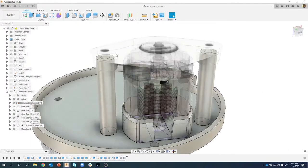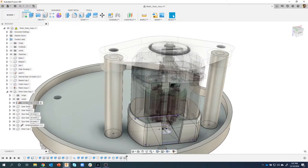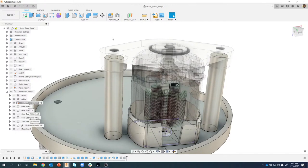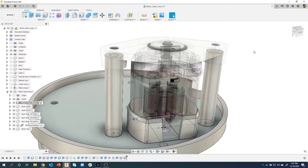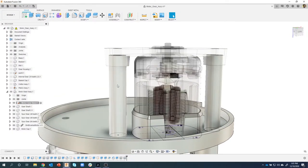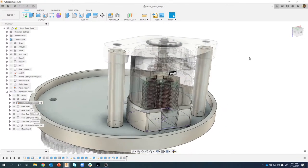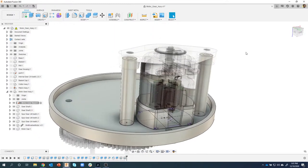Okay, because if you remember the steps that we did to build this motor cap, I created a sketch on the top face of this pillar. Well, because that pillar moved down, so did the sketch. So did my extrusions and everything like that. And even my holes are still half an inch deep from this face. So instead of doing what I call the hack and whack method, I think it's really a good idea to go back and fix what you can in the timeline. Okay, we're gonna run over as usual.